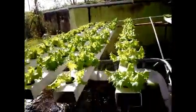We have a one-pump system, meaning that we only use one pump to pump the water and the rest is gravity fed. We have the pump in the sump tank pumping the water all the way up the lines and gravity feeding it back into the major tank. We are making use of gravity and minimizing the amount of electricity used in the system.